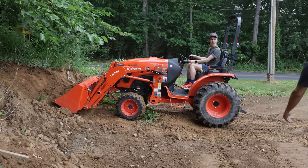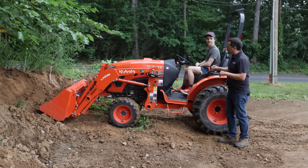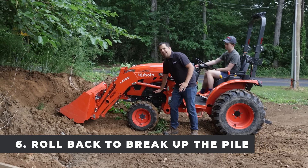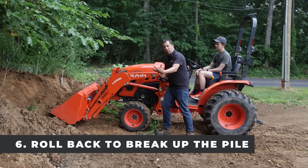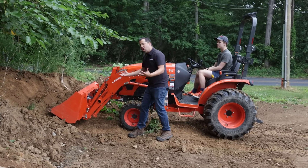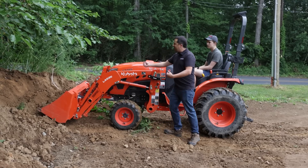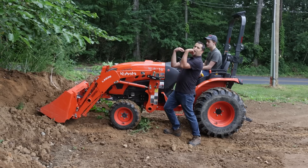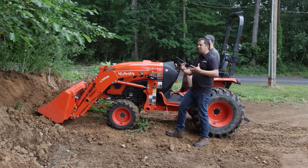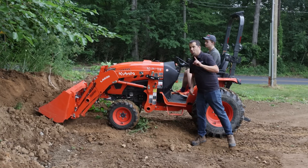Your loader won't lift? All you have to do is roll that bucket back. If you think of where you have power in your loader, this lift cylinder has a long fulcrum on it compared to the bucket curl cylinder at the bottom. So when you go into that pile and can't break the dirt loose, try curling that bucket back toward you. It's going to fill the bucket and bring the soil back into it — and you have vastly more power to curl with the bucket than you do by lifting with the boom.